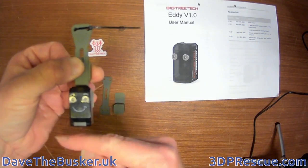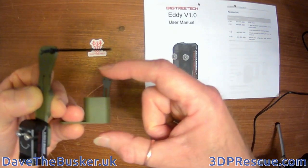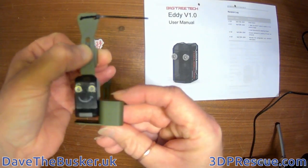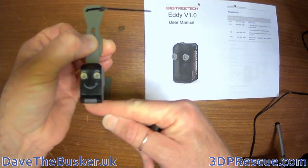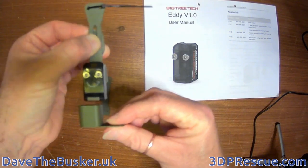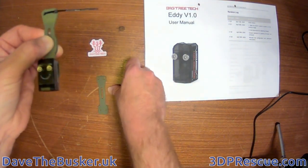The gap between eddy and the bed should be between one and two millimeters. There's also this step piece that I made - if you print this at 0.2 layer height, this part here is about 1mm tall and this part is about 20mm. What you do is physically lower your nozzle so it's just touching the bed, then put this under eddy, slack the bolts off, lower eddy so he's just touching it, and lock the bolts up. Then you know you have about 1mm between eddy and the build surface when the nozzle is touching. Heat your nozzle up first and clean any filament off. The first step in calibration requires eddy to be 20mm above the bed, so you raise your gantry, sit this underneath, and bring eddy down till he just sits on it.